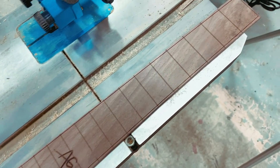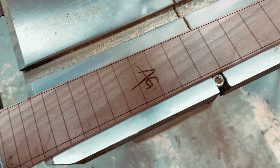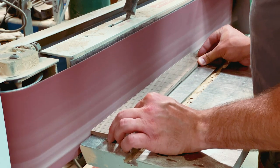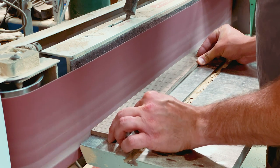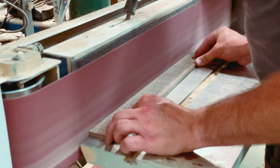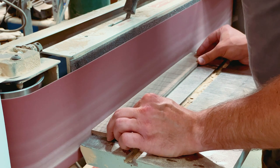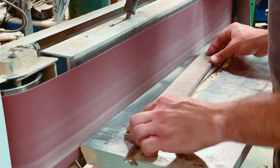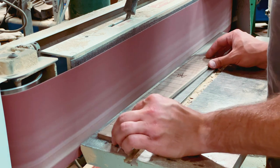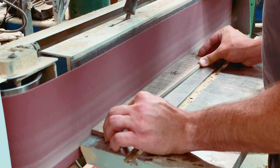The edges aren't completely parallel on a fretboard, so you can't really use a guide. Instead I'm just cutting them out like this, and then I'm going to use a sander. I have a fairly large sander to accomplish this. Another option is to use a plane — put it in a vise and then plane down the edges to your lines. But the sander gets the job done pretty quick, and a lot of people have belt sanders, so it's a reasonable option for a lot of you. The cutting and the sanding is all real time — I haven't sped any of this up. And you can see how quickly it goes for me to get down to those edges, to those marked lines, and end up with a really nice smooth edge.